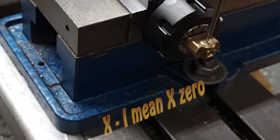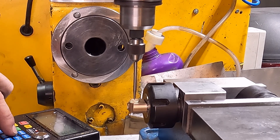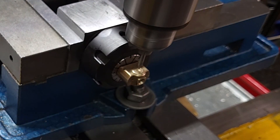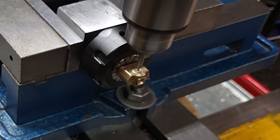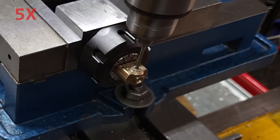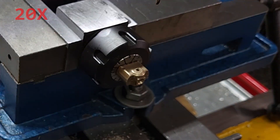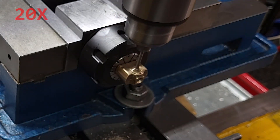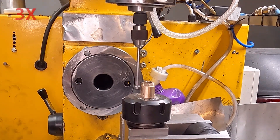Then I find the Z zero for the gudgeon pin — or wrist pin as Americans call it. Using a center drill gently to overcome the divot that's already there, and then drilling with the only 3/32" drill I could find, which I think is out of my Dremel kit. That sort of went okay until right at the very end of drilling it moved the collet block. Brass is funny. But the holes seemed okay once I cleared them out — though this part is getting dodgier by the minute.